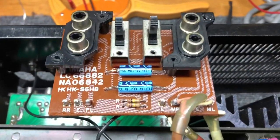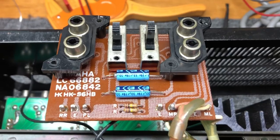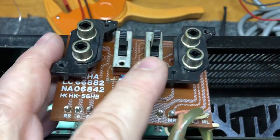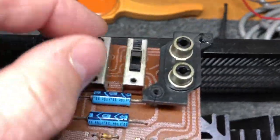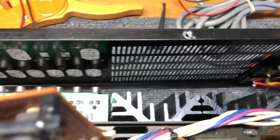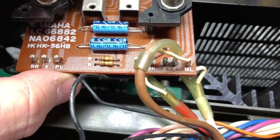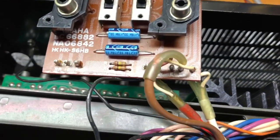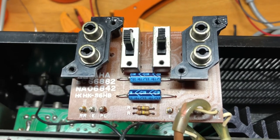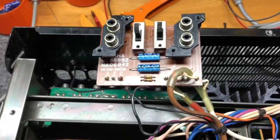Back with the CA-2010. This rear panel connector board — these boards on all integrated amps from Japan are always dodgy: dodgy switches, wobbly RCA connectors, and in this case they were broken. At some point this thing has just been absolutely smashed, and people have bodged in repair wires; there are lifted traces and all sorts of rubbish. So the best thing I've done is directly bypass all of that — directly connected the pre-out with the power-in — doing away with all the bodgery, which should reduce the signal path problems we've been having.